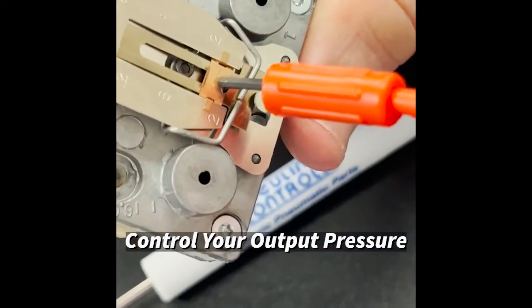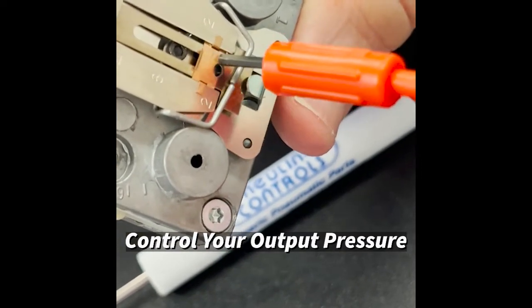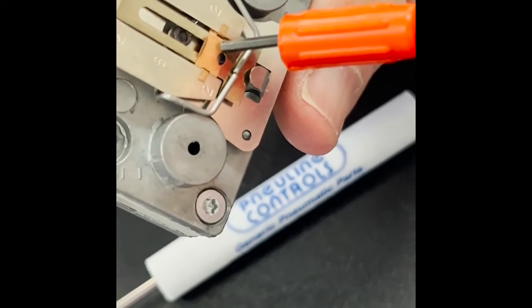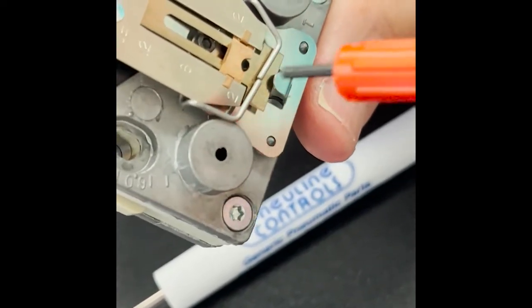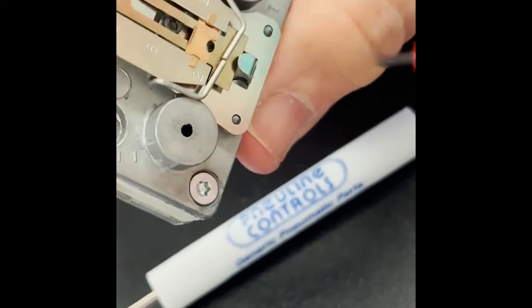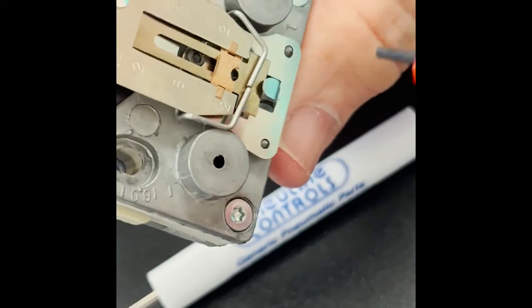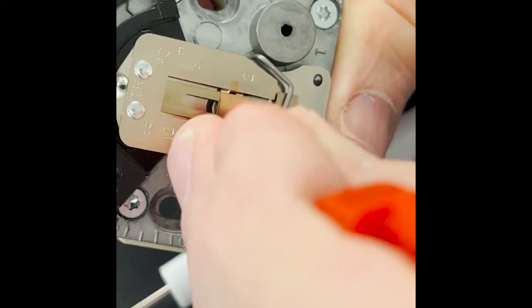This is my sensitivity or throttling range slide, and note that out of the factory, this is the position that this slide is in. If I don't make an adjustment to this, what I have effectively is a two-position device. So I need to make this adjustment as a first step in terms of calibration.